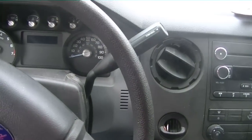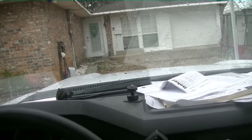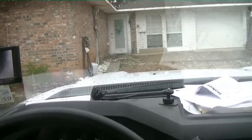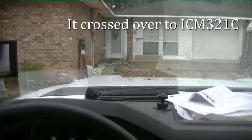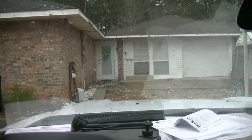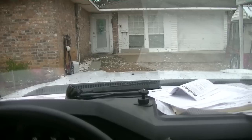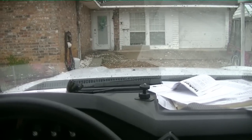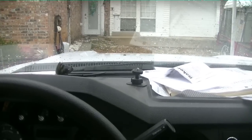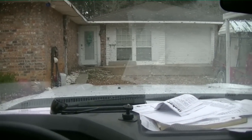No luck on the defrost board — nobody in town has it. We have a Carrier store here, and it did cross over to an ICM board, but it seems like everybody that handles ICM here has every defrost board except that one. So we'll probably just go ahead and call Carrier and get the OEM board since she's going to have to wait anyway. We'll revisit this when I get the new board.